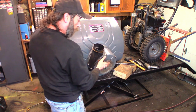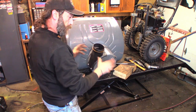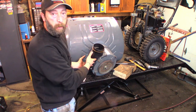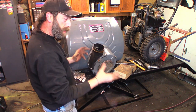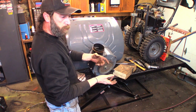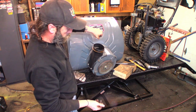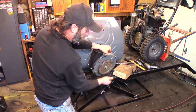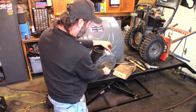We've got that pillow block bearing now secured. It's like a chess game - you've got to put things together in a certain order, or else you won't be able to tighten the bolt or get the impeller in. So it's a kind of pre-assembly - wiggle it in and get it half aligned with blocks of wood. Then I was just pulling on the impeller shaft with my hand and tapping the pillow block bearing under the pulley to get the shaft to come through that bearing. Got the nut on there nice and tight.